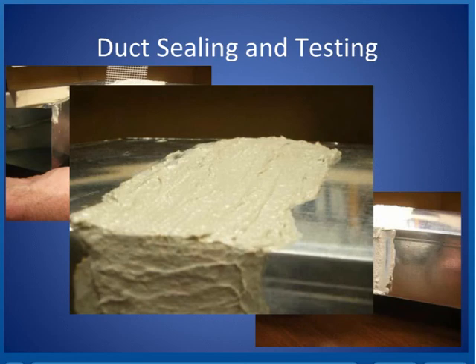Other areas I've seen it crack if it dries out. There are some mastics that are hard, and those you want to put on very thin. You want to follow the manufacturer's directions for whatever type of mastic you're using — it's important to know whether they want it put on very thin or whether you can just apply it thick like this stuff.